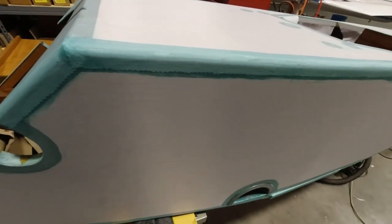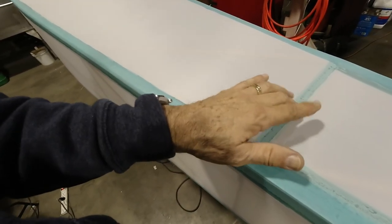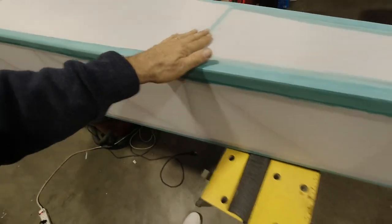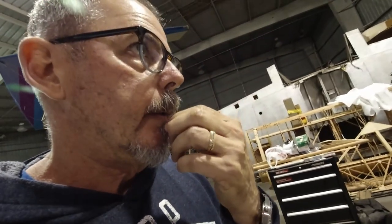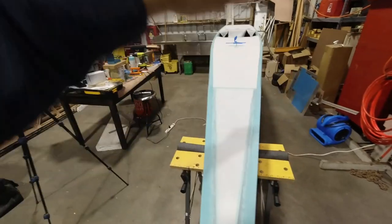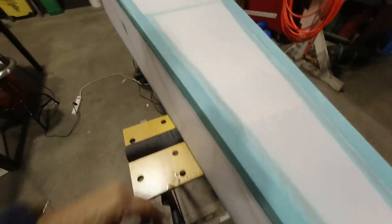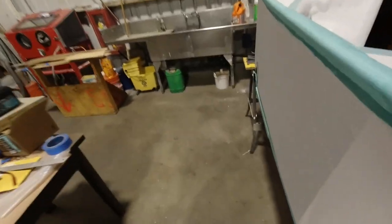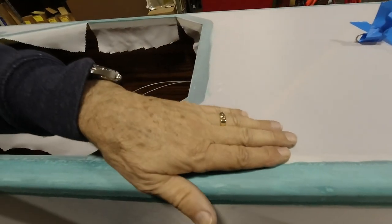And once we get this cross piece, the cockpit area, this piece here, and the doily there, this will just get cut out. But this corner here will get a piece of finishing tape, and then a piece across the back here. Basically when you're doing your tapes, we'll do all of the ones going across the fuselage first, and then we come back and pick up the ones going all the way down the longerons. Once the tapes are on, then we can finish sealing the fabric here. And just this section where there's plywood, we'll attach it here as well.